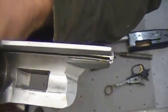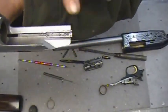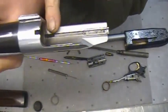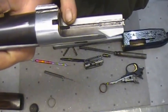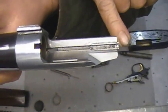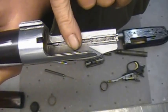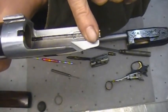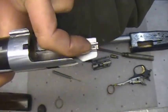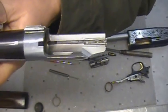This is our barrel. This is our ejector shelf, this little piece right here. So when our bolt and our barrel come back with the shell, the bolt is going to stop and this barrel is going to go forward. When it does, it needs to hold the shell to the side so that this little edge can grab and make it go this way and pop it on out. That's why this shotgun doesn't extract. Plus everything is gunky and dirty.